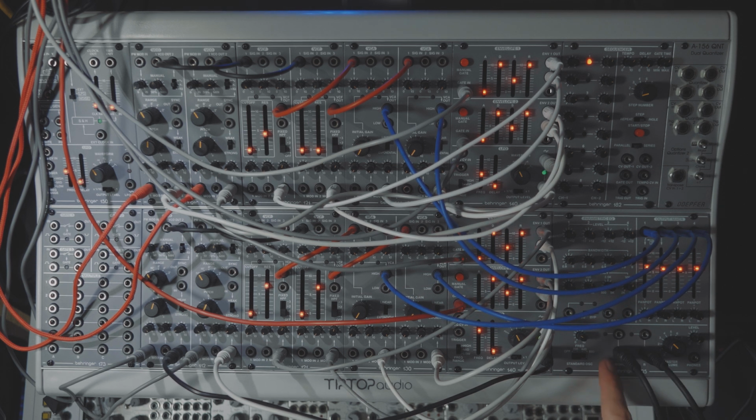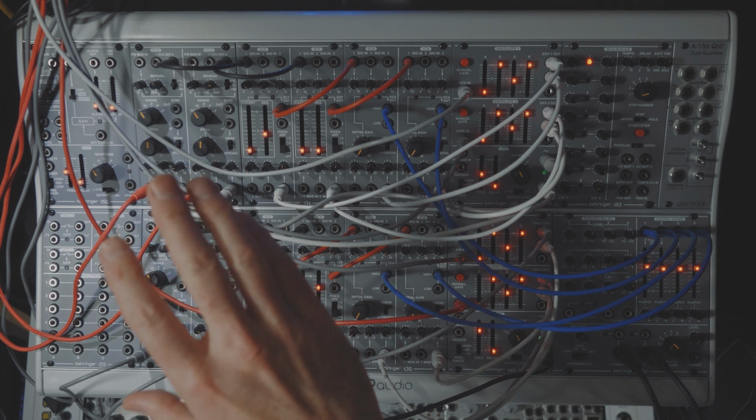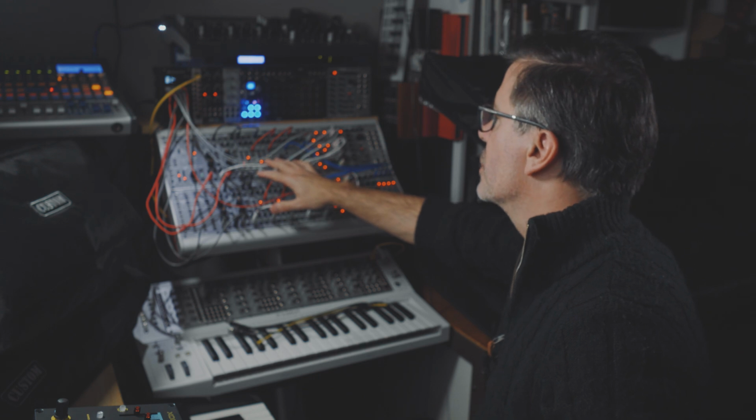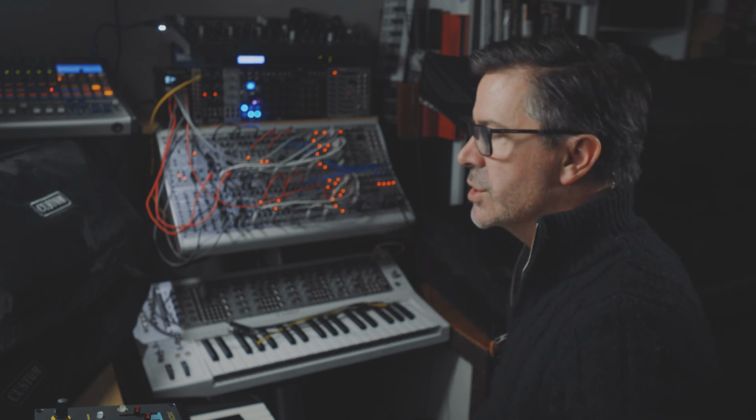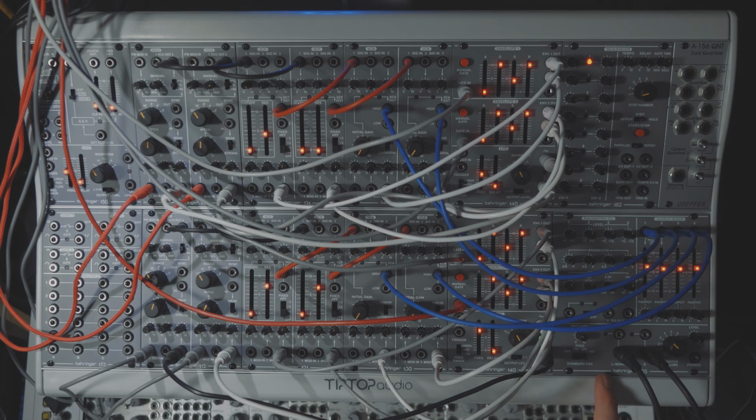And what else does this module have? It has, which is really handy, a standard oscillator tone, and I use this for tuning. So you can have 220, 440, and 880 hertz, so 3, 4, and 5, to tune against, which is really handy because we're dealing with pure analog voltage controlled circuitry. There will be very slight drift over a period of time with any voltage controlled oscillators you'll find in eurorack, and it's nice to have something to tune them against right here. And it's got its own little mix level there, so you can mix that test tone in.